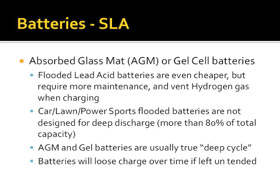So, starting with sealed lead acid, because this is the most common battery a ham's going to have. Absorbed glass mat or gel cell. Two different technologies to create a sealed lead acid battery that is, well, sealed. And does anybody know why a sealed lead acid battery is important? What does it not do that a traditional flooded battery does? Yeah. That's right, it doesn't vent.